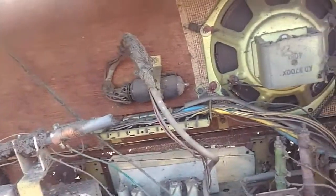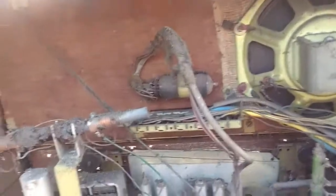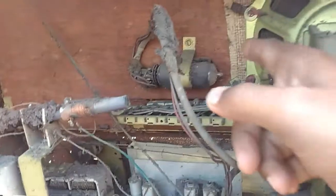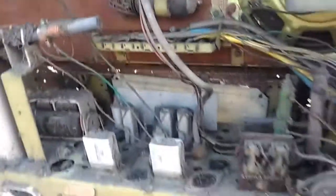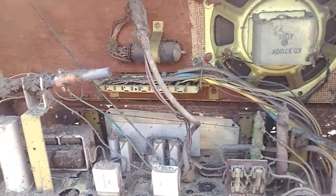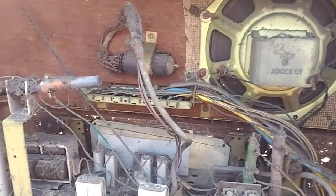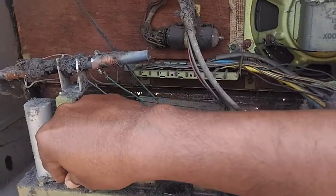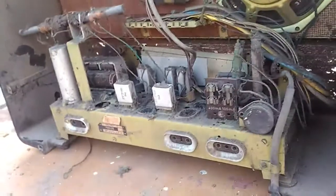The loudspeaker seems to be in good condition, though I can see some cracks on the diaphragm which we can repair. That's the ferrite rod antenna for medium wave, and there's a magic eye. These are the IFTs — intermediate frequency transformers — and you can see the amount of dirt in them.